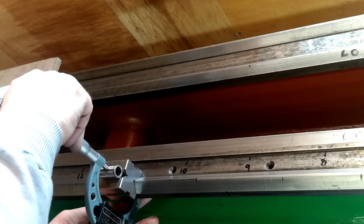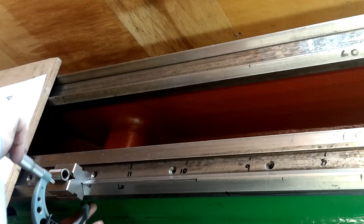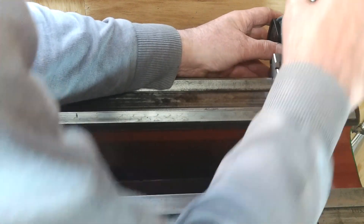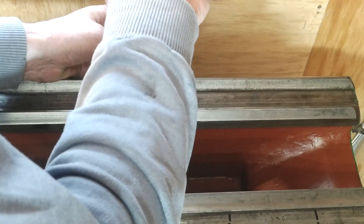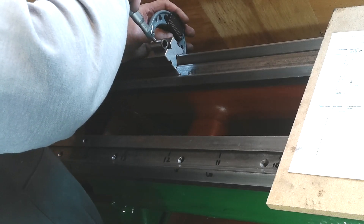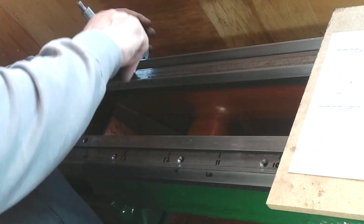From all this I will have the three required surfaces to assist me in correcting the surprisingly large amount of wear on the main saddle bearing faces. I now know that when it's time to sort out the V-slides I've got my work cut out. For now I've got to get back on with the scraping process to remove the error from the front face. When I've finished scraping that last face I can get on with making some sort of contraption to correct the main carriage V-slides — but that's for another video. Thanks for watching, see you next time.